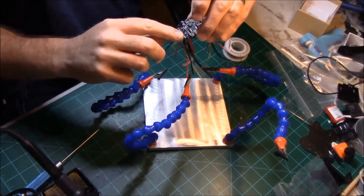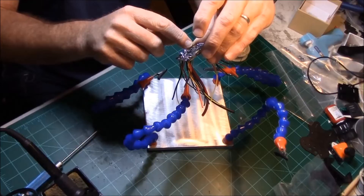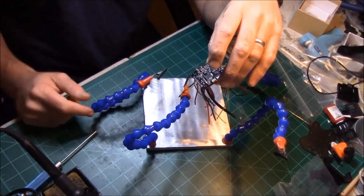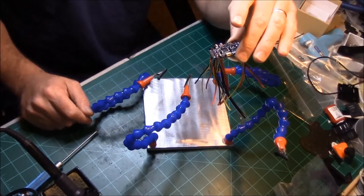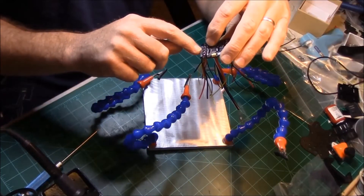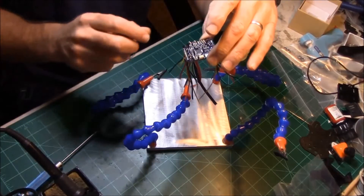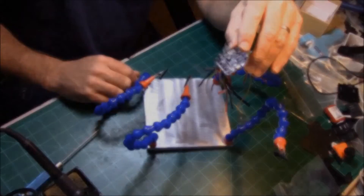I need to do some stuff on the back — an LED and a buzzer. Then I'm going to hit the LC filter pin for the VTX, and I'm going to run a couple of extra wires for a transponder up there too. I'll flash up the diagrams so you know exactly which pins I'm tapping into before I do it. Anyway, that's it for the ESCs — now I'll go ahead and attach the LEDs, the RGB LED, and the buzzer leads using 20 gauge silicone wire.